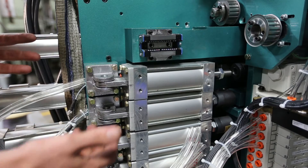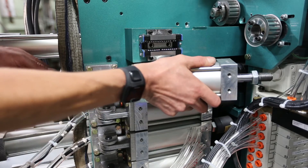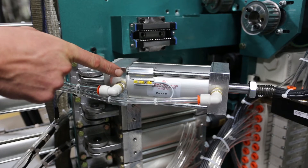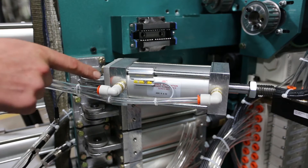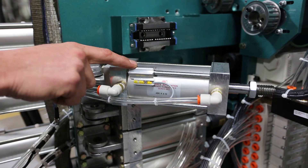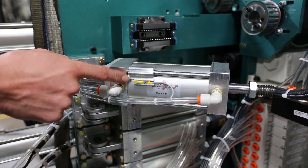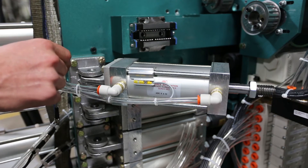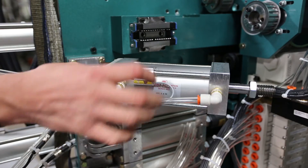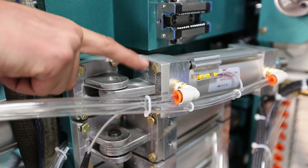Use your fingernails or a screwdriver to spin the snap ring around until you find the start of it, peel it away by pulling up, and walk it out. Then drop the pin out. Now the cylinder is ready to remove. Your air lines are back through here — pull out, push forward, and walk it completely out. This cylinder has magnetic eyes on it. Earlier models might not have this bracket with the eye. If it doesn't, you don't need to worry about transferring it to your new cylinder.